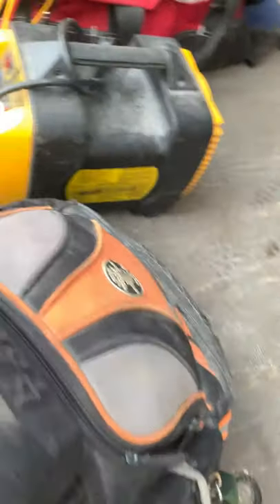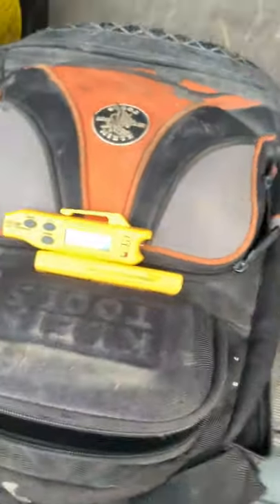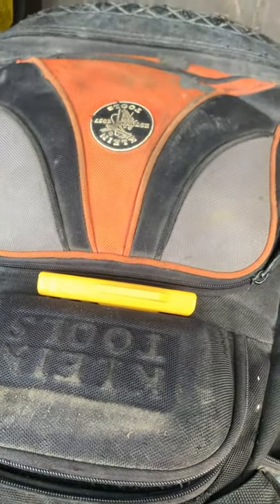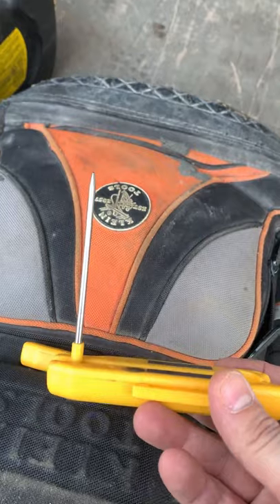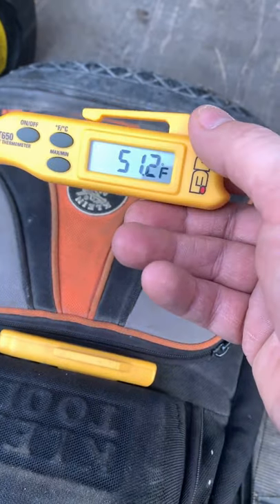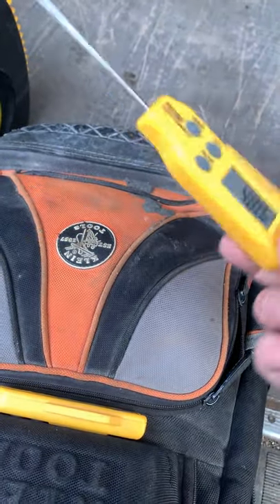Opening up the front pouch, I've got some thermometers. The reason being is you're going to have a temperature difference between two points — I'm going to measure the intake and the return and the supply temps, get the difference between the two. It's easier if you have two. I like these because they're bendable — I put them into the supply or the return and the little magnet sits right there, giving me a direct reading. Attach it right to the duct and it's going to stay.